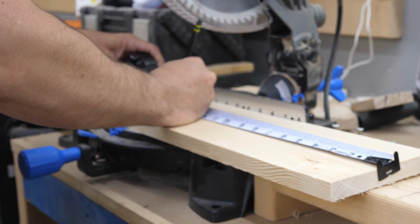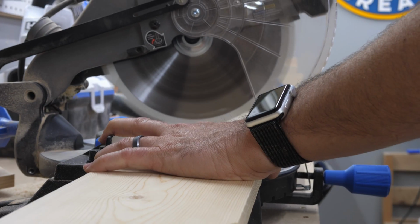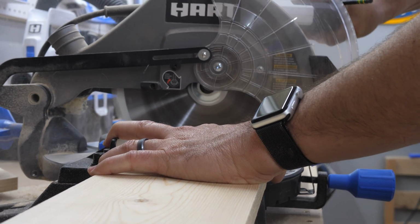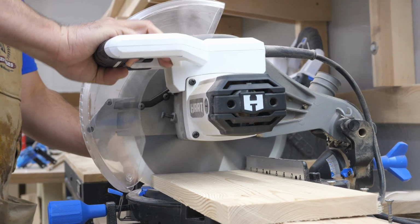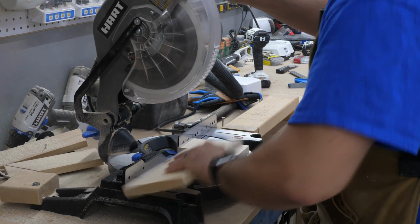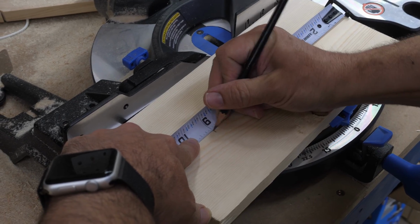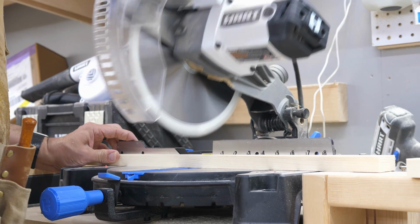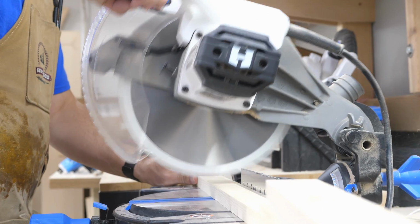Fortunately for us, to make these box vases, all we needed was a 1x6 and a few 1x2s, both of which we had plenty of. We started over at the circular saw where we cut the front and back pieces first. Now Jen wanted 3 vases all in different heights, so we cut a pair of 15-inch, 12-inch, and 9-inch pieces. Next we measured the 1x2 and cut a pair of each to match the front and back pieces.